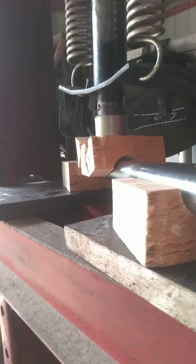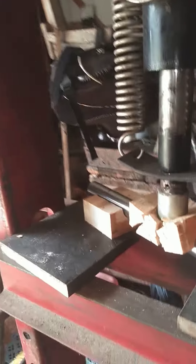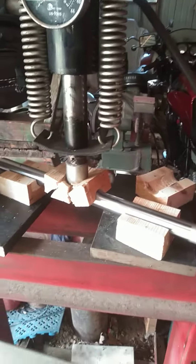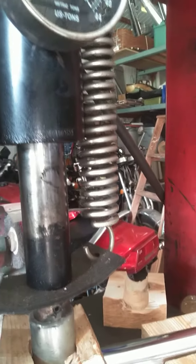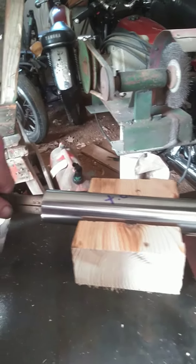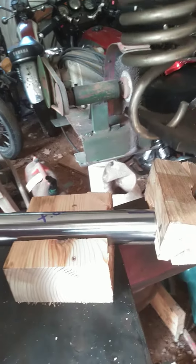If you sight along the tube — a little bit hard to tell with the wood blocks — but on these 35 millimeter tubes, I just slid a one inch ruler inside. That happens to be a fairly snug fit, and you can tell by how far in the ruler goes how much bend you've got. You've started to straighten it out when it goes almost all the way in, and when you start to bend the other way, you get less ability to insert it. Because this one is so bent, I'm giving it just a little more.